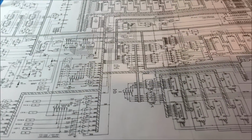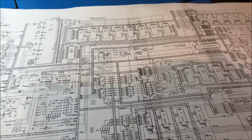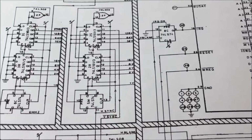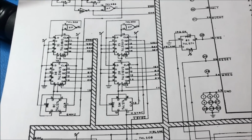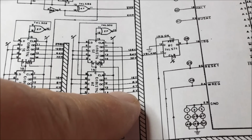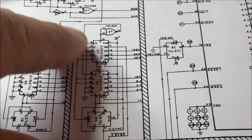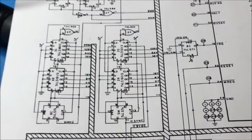Okay guys, I have tested a lot of the stuff in this video section, and I'm having a hard time finding anything that doesn't look right. So I'm going back to the vertical count, and I'm going to verify that it actually is correct by analyzing it. I'm going to be on the 8 bits of the counter itself, from 2V all the way up to the sync signal, vertical sync. I'm going to be monitoring the load. I'm actually going to be triggering on the load pin and going out from there.